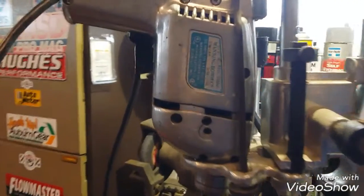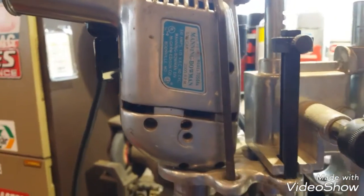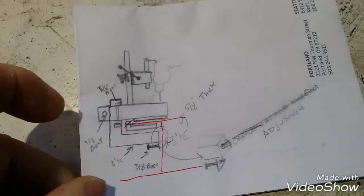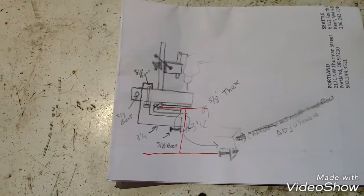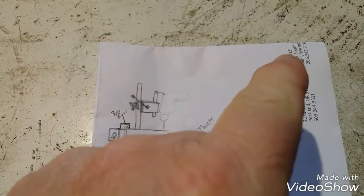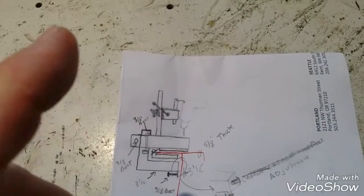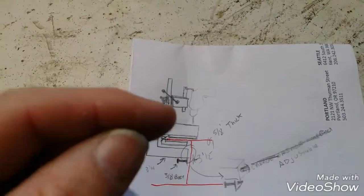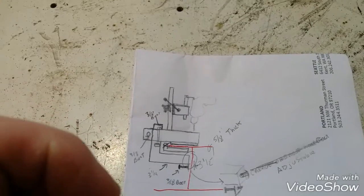Good day YouTube. Today is Friday, the 14th of December 2018, and we got a little fab project to build. We have some very interesting little LED strip light fixtures to install on an I-beam structure — an I-beam that goes up about 12 feet then cantilevers out about 10 feet. We have high-end LED strips to mount on little stainless clips, and those clips are going to be screwed to the I-beam with 10-32 stainless screws.